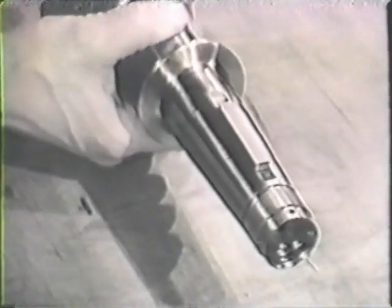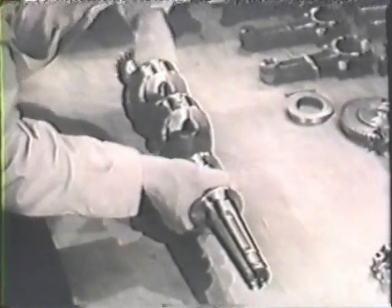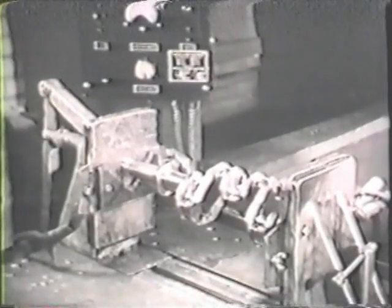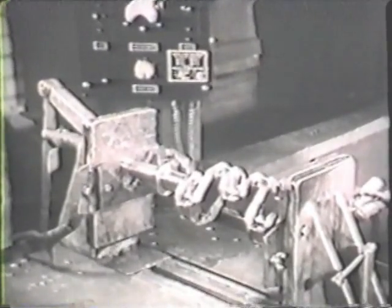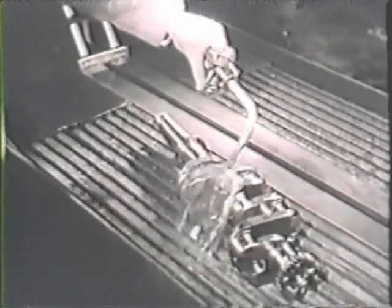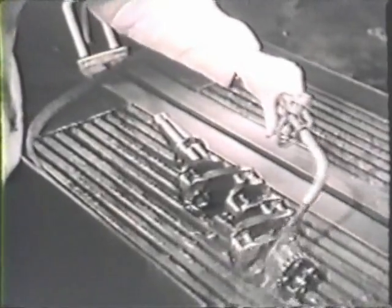Ordinary visual inspection of the crankshaft is not enough, however, as fractures can't always be seen. The use of some kind of particle inspection is a more certain test. In the magnetic particle inspection, the crankshaft is magnetized by sending a charge of electric current through it. The shaft is then thoroughly soaked with a solution containing magnetic particles. If there's a fracture, the particles contained in the solution will adhere to the edges of the fracture and make it visible.